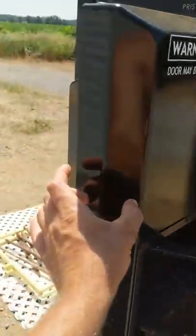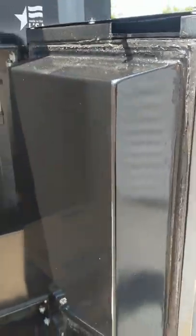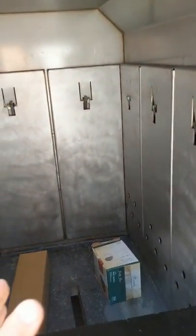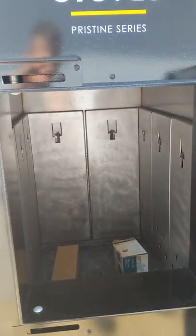There's actually an air gap here with an extra insulation panel that's going to cut down on condensation around the door frame. Nice silicone rope gasket, nice quarter-inch thick steel plate door, big loading door. Tall, narrow firebox, which is good for a gasification boiler because your fire is actually down below in the gas chamber, so the wood has to fall down on top of each other.